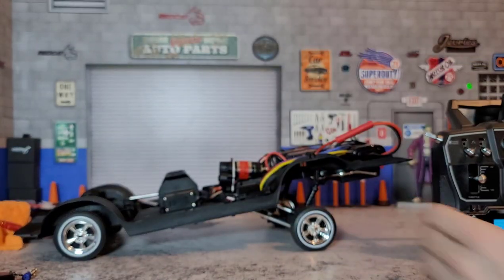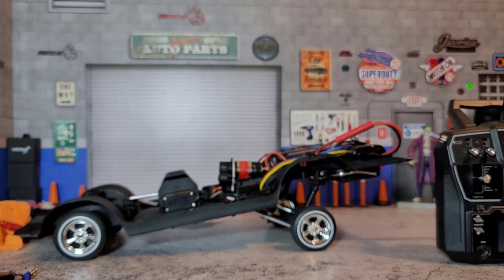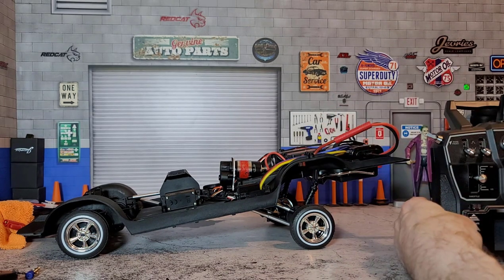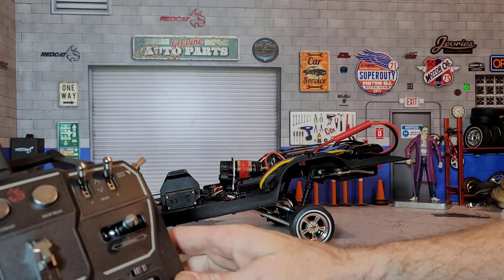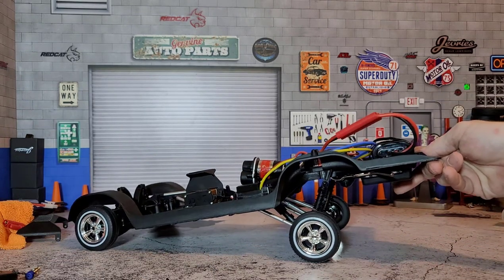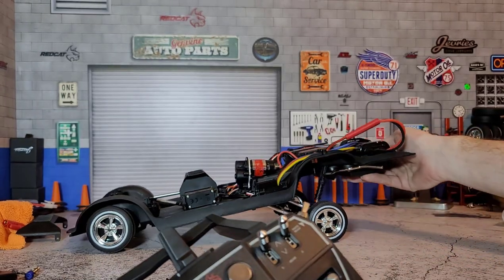Now, this is also tricky, but it's pretty simple because you can actually watch what the servo is doing. When you're going down on the number, you're reducing how far it travels. So because it's going too far, going down on this number will reduce that number and make the servo go less far. And once we got the servo perfectly in line, let me see right there, we got that nice and perfectly in line, then we're good on that servo for the upside.